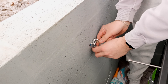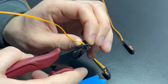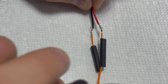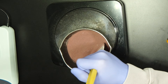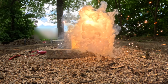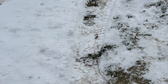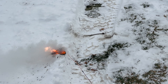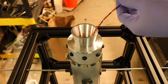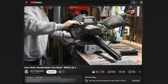It was time to install one of the most important parts of the motor: the igniter. To make this igniter, I use a modified e-match and form a small ball of propellant around it. Because of the size of the motor, I added additional wiring length so I can route the igniter leads all the way to the forward end of the motor. The igniter uses the same propellant as the motor itself, but with added aluminum powder to increase the burn temperature. I've tried several different igniter methods on my previous motors, and this approach has proven to be the safest and most reliable. Before installing it, I did a quick test fire of the igniter. Once the igniter was installed, I reapplied the tape over the nozzle exit — this is going to help build pressure slightly during ignition. If you're interested in how I built this test stand, I have a full video on that.